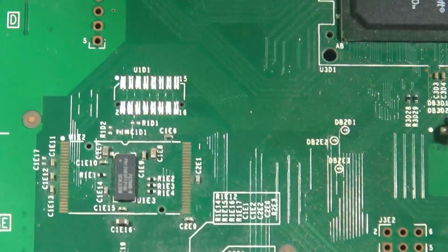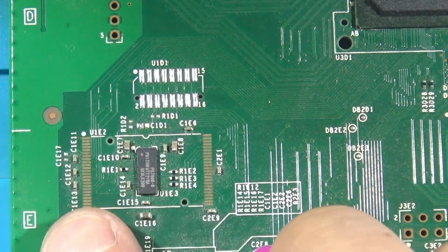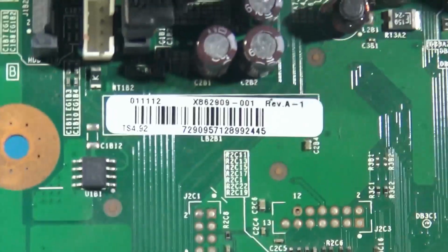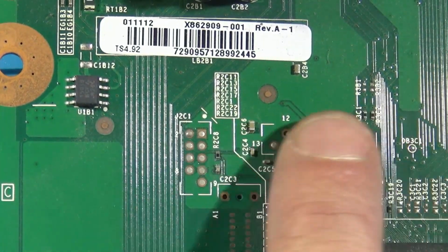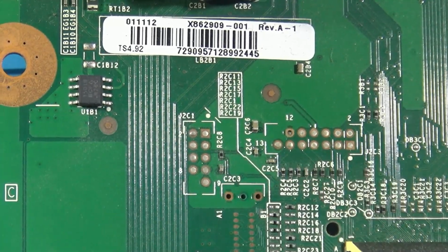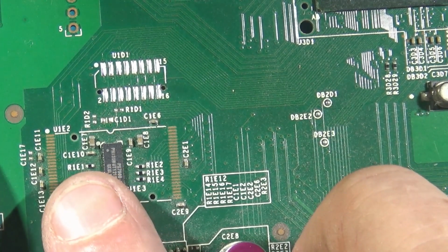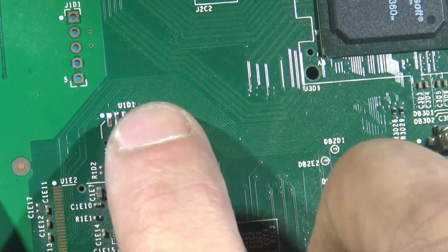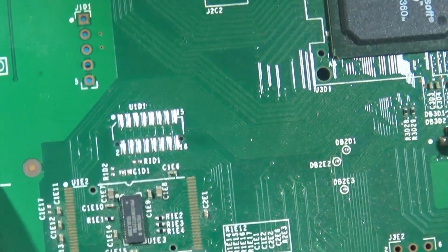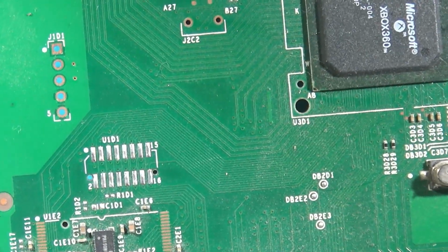First thing, just to go over it one more time, first thing is what type of NAND chip. If it's fully populated, then you dump the NAND with the standard NANDX JR programmer. Use these pin headers. If it's a small one like this, you're going to need to use the SD tool, which gets soldered up right here, or the nice new all-in-one X Flasher 360.